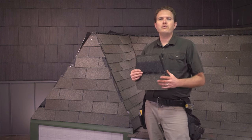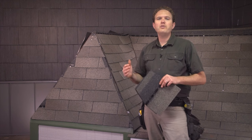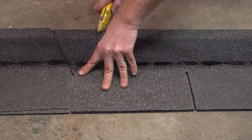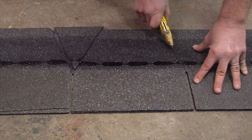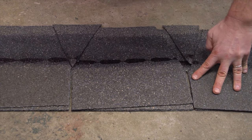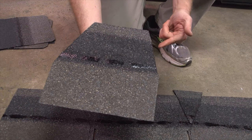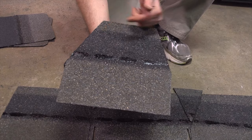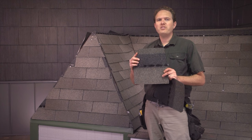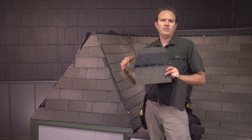To make a three-tab shingle into a ridge shingle, you need to make just a few cuts. Take your razor knife and hook blade and cut the shingle into three tabs right at the cutout. Once you've got a stack of three tabs, come back and trim off the back corners of each shingle — or do it as you go along. You'll end up with a piece that has slightly beveled edges on the back and side that's going to get covered up. This prevents the back end of the shingle from sticking out around the edges of the overlapping shingle.